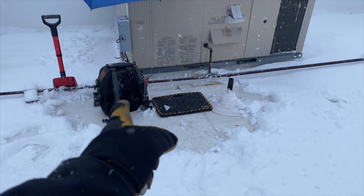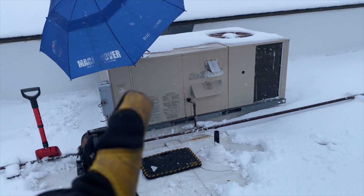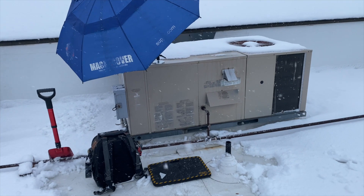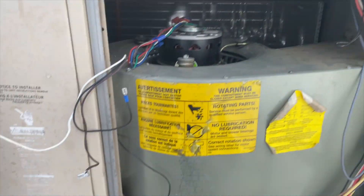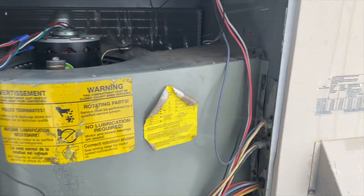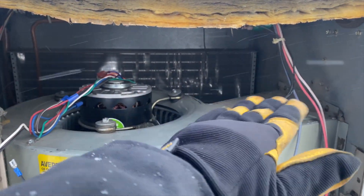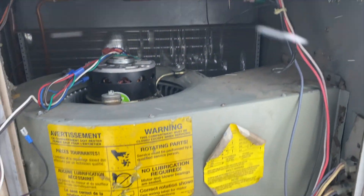I'm trying to prevent some of the snow from getting into the unit. What I'm going to do is pull the blower out and take it to that little room I was in at the start, install the motor and everything in there, then come back out here and just pop the blower back in. So we'll see how difficult this is. I got the wires disconnected — I think it's these two screws here and then it should just slide out. I'll unplug all the Molex plugs, pick it up, turn it so this part comes out first, and bring it out.